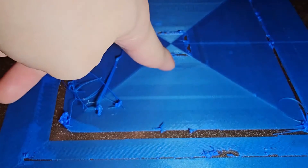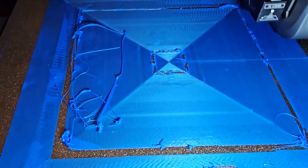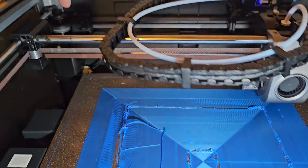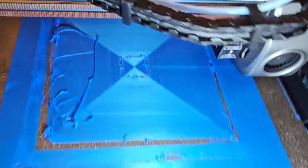As soon as it gets past that lifting area, it starts printing really nicely — maybe that part of the surface is different somehow. This side is printing really nicely now, and this side and that side are still good too. We're hearing less and less of that vibrating sound. I think it's coming from this motor over here — that's why we keep seeing ringing and vibration.